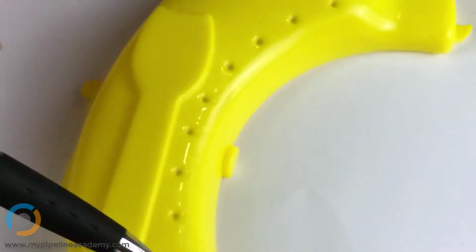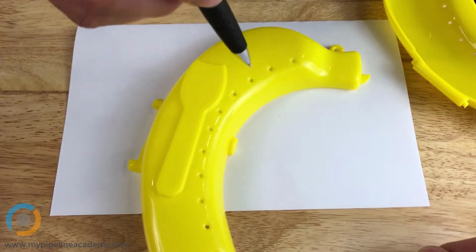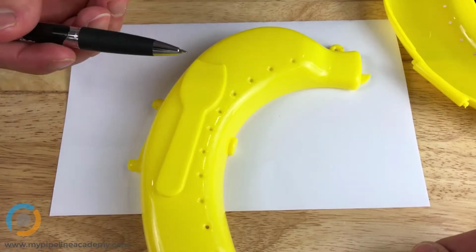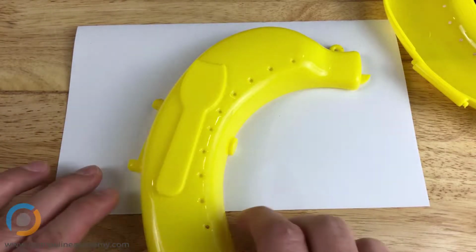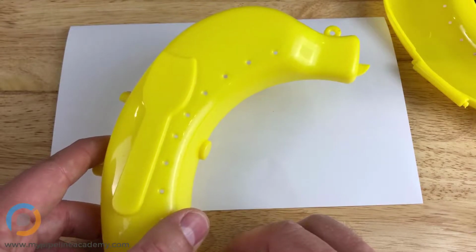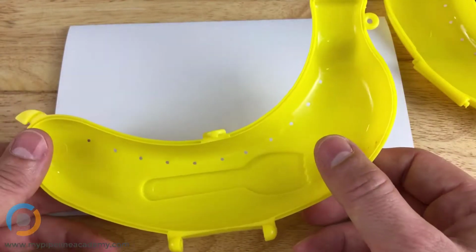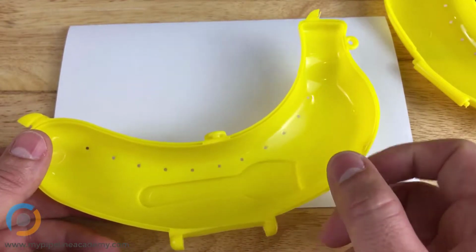But you also have holes all throughout here, so wouldn't it have been a lot cheaper to produce the part with the shutoff instead of the side action? It would have been, and it really comes down to preference. Functionally, this would have worked just fine if you had used a shutoff, but someone's preference was to not have a shutoff there and to use a side action instead.